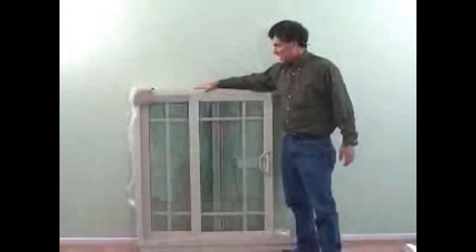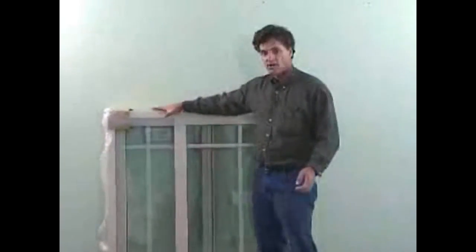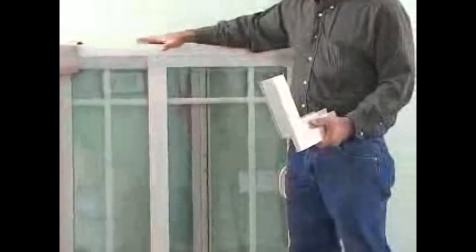This particular frame is a block frame. It's available in new construction with a nail fin, or you can get three different retrofit choices: the single wall thin fin, the dual wall, or the brick molding fin, which is the three-quarter inch fin. I recommend this brick mold — if this door is going on stucco, this is the best look.